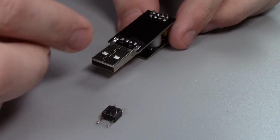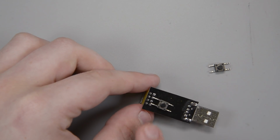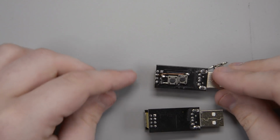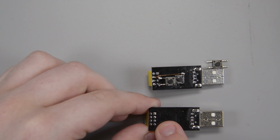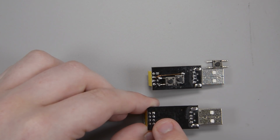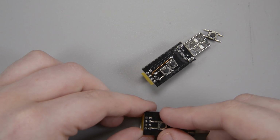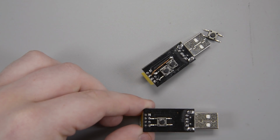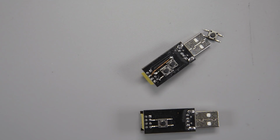And the first button, I'm going to take and solder onto ground, which I believe is referencing off of this one. Ground is this pin here, all the way on the front right corner here from the camera's point of view. The front right corner, and just skipping one over, and that is GPIO 0. So soldering those two pins to two of the little legs of the button will get me my GPIO 0 and ground connection.